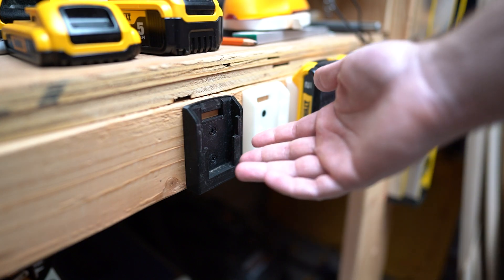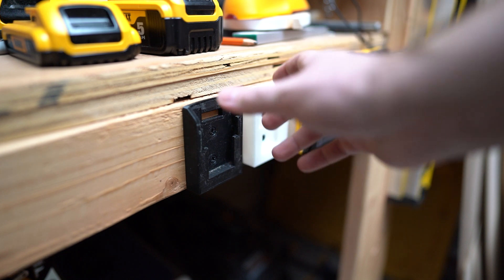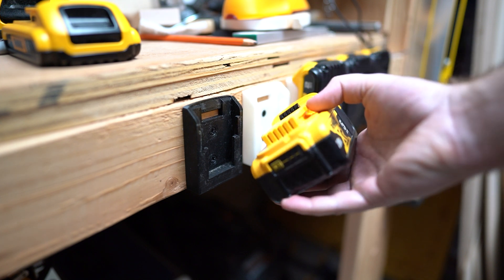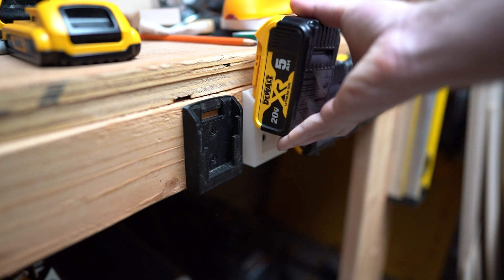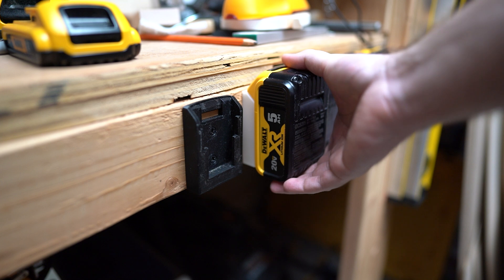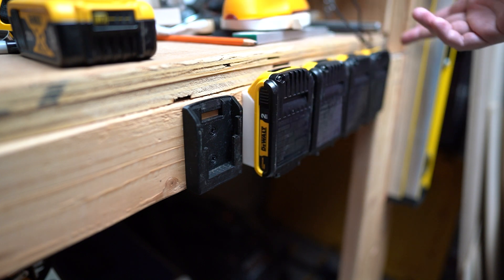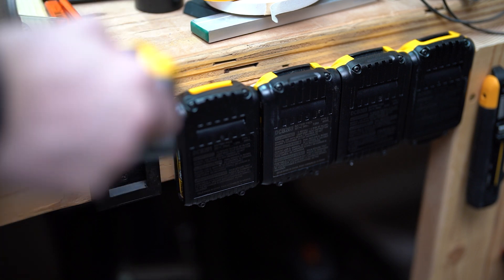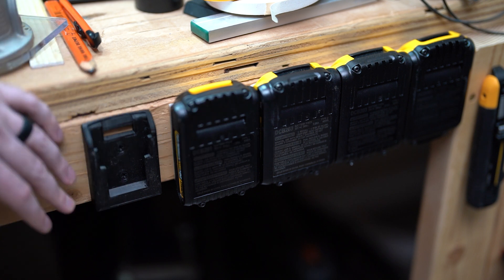One of the first things I designed and printed were these little battery holders. I didn't invent these, but I did design them myself — it's a great exercise. You take your batteries, use digital calipers to measure all the intricacies, and then create a negative space for them to sit in. Now I've got a battery holder that keeps batteries off my bench and locked in place so I won't accidentally knock them off. These are fairly cheap online — like $20 for five. But printing five off after I designed them only cost me about a dollar in filament. And there are websites where you can download print files from people who are much better at modeling, and some of them are free. I'll put links in the description.